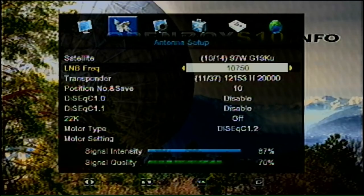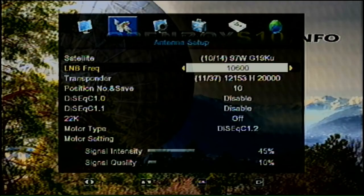For example, the KU-band/C-band LNB that I used to have on my C-band dish would have to be set to 10,600 for it to work. If I had it at the other setting of 10,750, it would not work. So it's very important to have it at the correct setting, or else you're not going to get any signal.